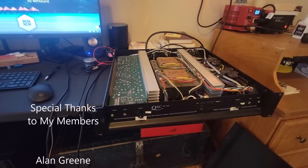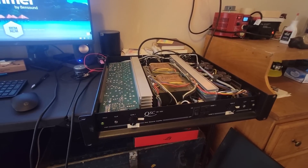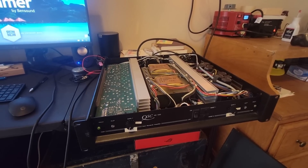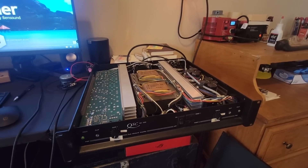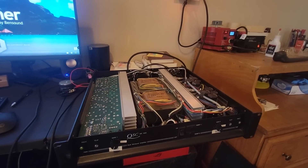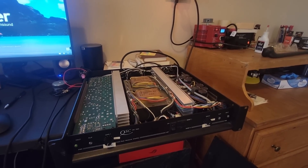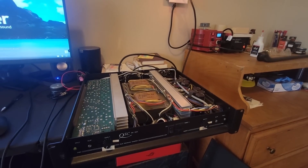That's gonna do it for this video — a relatively easy fix this time around, and I'm very surprised. The only thing causing the fault was the potentiometer going to high resistance and sending the amp into protect mode. For now she's working and that's just fine. Hopefully you enjoyed this video and followed along. Thank you for watching this episode of 'Having Fun Repairs.' If you have audio equipment in need of repair, you can reach out through my website. If you're new to this channel, please consider subscribing, and if you liked this video, give it a thumbs up. Take care and goodbye.